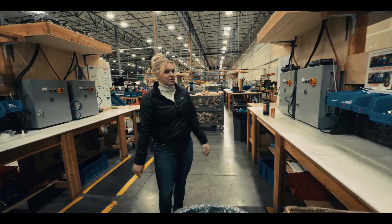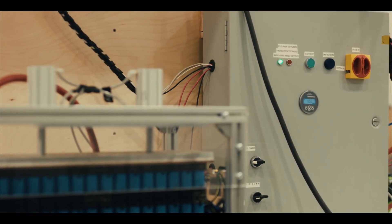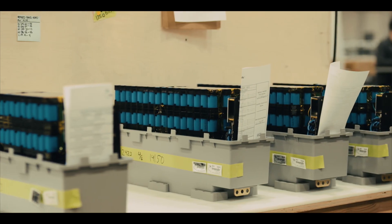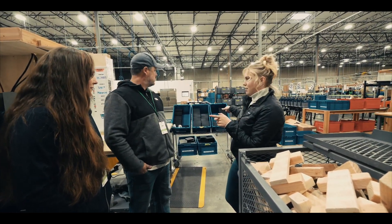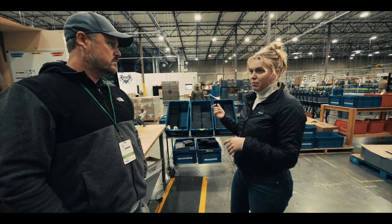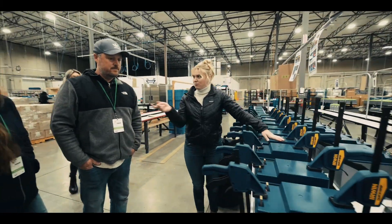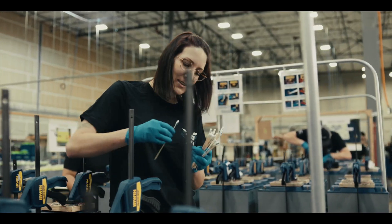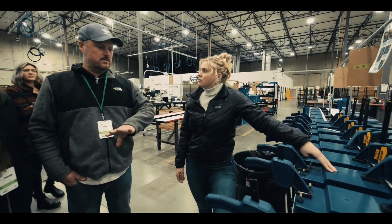After the battery has the BMS attached and the battery is completed, we actually test the battery as a whole. This is going to shoot 200 amps into the battery to make sure that it shuts off at its cutoff, and then it will recharge and make sure it's charging and functioning as a whole battery. There's space on each side of the battery where we put these shims in — neoprene foam and plastic plating — which actually helps us with our UL listing because the vibration can handle it with that padding in there.